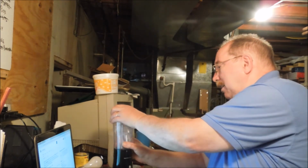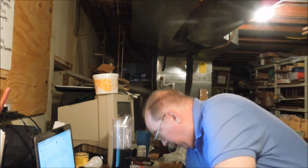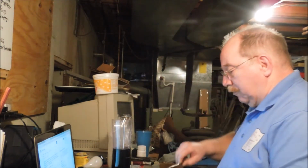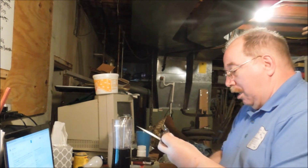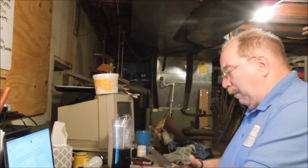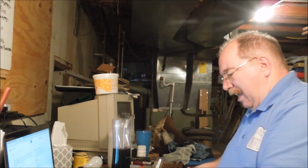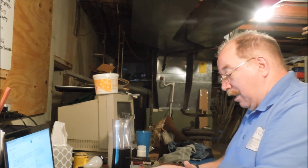I think my pieces are too big. They're nesting up in the top, and they're not getting down where the blades are. I already ground up this much of it, but I had it cut into small pieces. So we'll get out the tray, and I'll use my recycling shears to chew it up a bit. I probably could dice it up small enough just using the shears to run it through the extruder, but I think having a really fine grind makes it work better in the extruder. At least it did with the pop bottle caps.